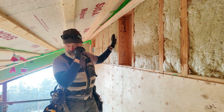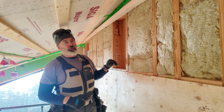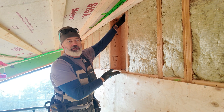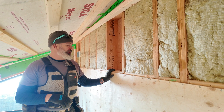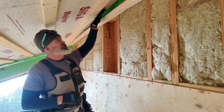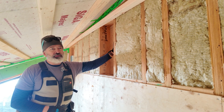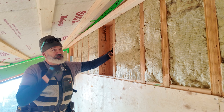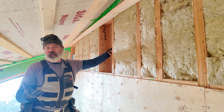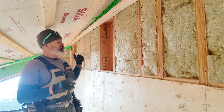We forgot — being overzealous completing the shear wall — to insulate this little strip here. We really only need to insulate to about here, but the blocking's already in place so it makes sense to insulate the whole thing. Sometimes you have to go backwards to go forwards, so we had to pull a couple pieces of plywood off and about a dozen nails just to verify our air control layer and thermal layer are complete. The key thing is you never judge anybody by the mistakes they make — you judge them by what they do about their mistakes. We made a mistake here, we fixed it, and we're moving on.